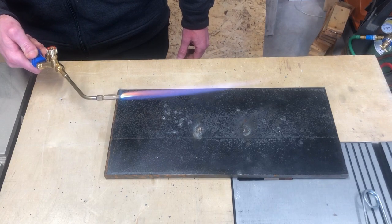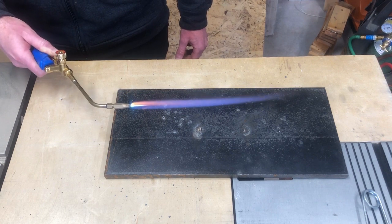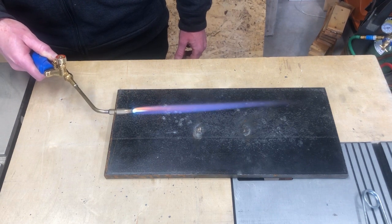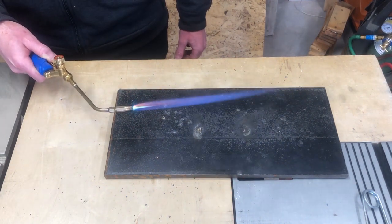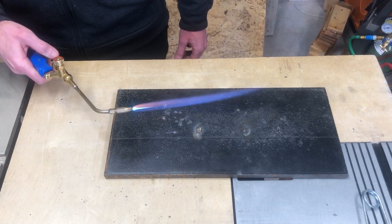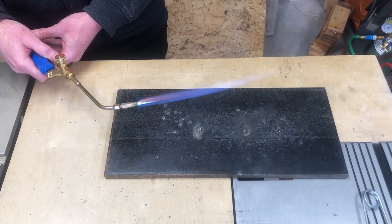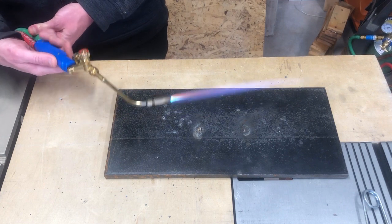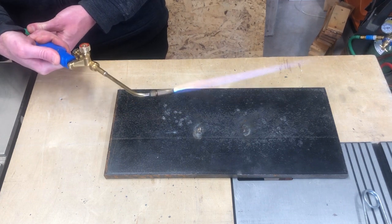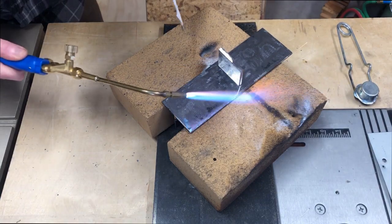I want to demonstrate the slot in the needle valves. If I press on the oxygen knob, you can see how it cuts off the oxygen and changes the flame. If you're using the torch and press up against something, it will change the flame. Once I've attached the hoses, I hold the torch further back, so I have not found that to be a problem.